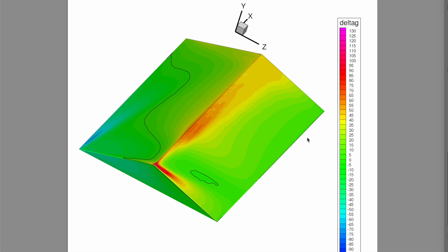What happens with any roof when wind blows over it is almost like blowing over an airplane wing — you get low pressure on the upper surface and higher atmospheric pressure below, causing uplift that wants to tear the roof off. There's a fairly even distribution of 5 to 10 PSF over much of the roof, but there are peaky areas near the gable peak and along the ridge where uplift can reach 75 to 110 PSF.